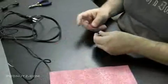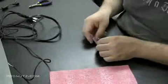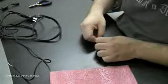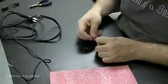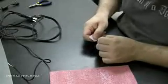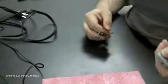Right now I'm going to sand the leads that go into that adapter plug. See, that adapter plug is meant to be plugged into another adapter. And it gets really expensive at Radio Shack when you start buying adapter upon adapter. So sometimes I like to solder the leads for the power adapter directly to the leads on the adapter plug. But since they aren't meant for solder, I'm sanding them off, I'm scuffing them up, so that when I do solder the leads to that adapter plug, the solder makes a great connection. It's strong, a good bond, which won't break.